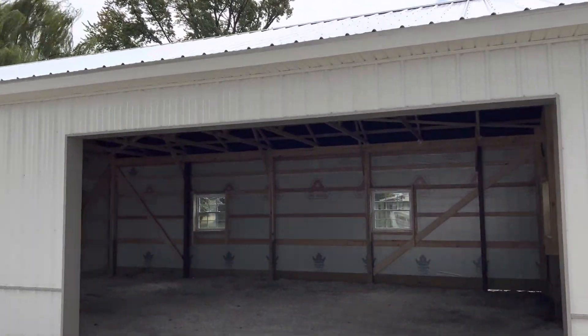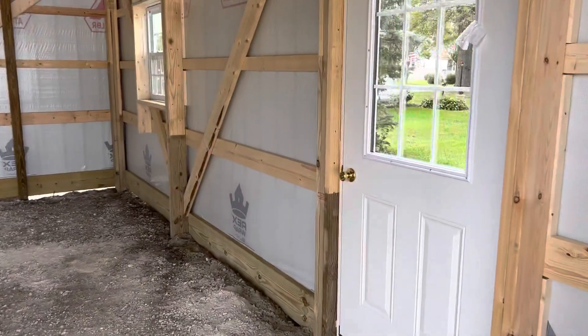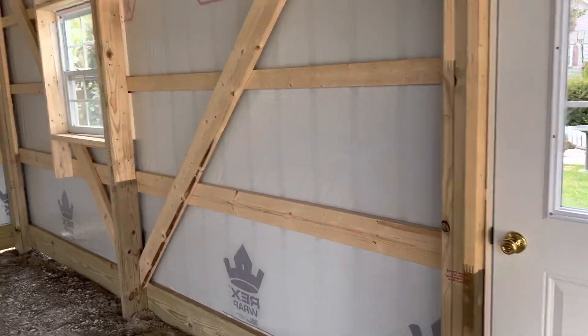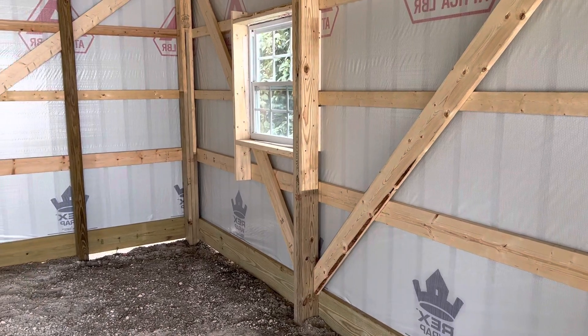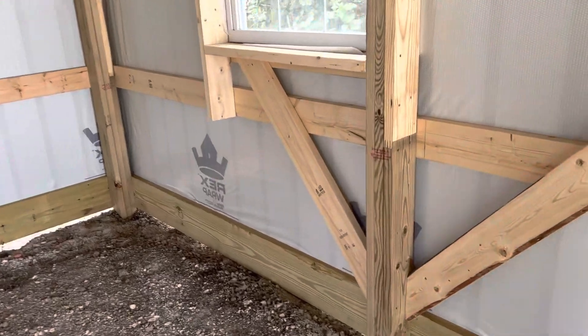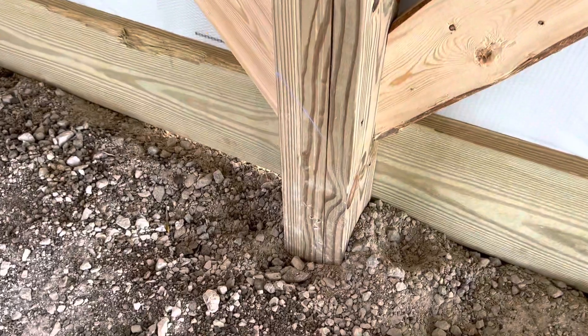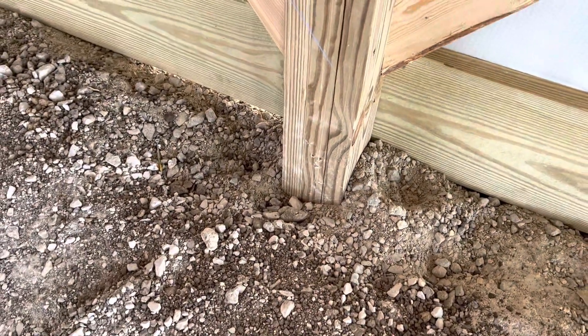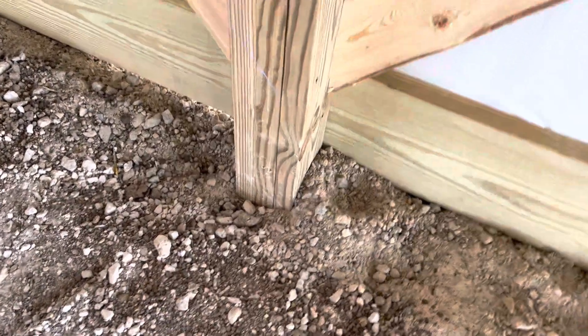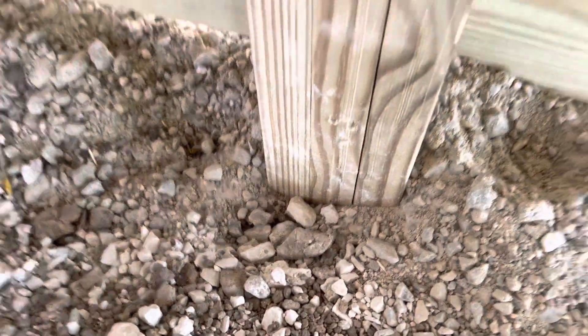Let's go inside and take a look. You can see the owners chose actually three-ply laminated columns — again, southern yellow pine, glued, finger-jointed, and laminated together, treated at the bottom. You can see that nice 2 by 10 rim board. We drill down actually 54 inches — this is again in Sandusky County, Ohio. We go down 54 inches, put that right on a concrete cookie, put uplift protection with treated boards at the bottom, and backfill it with 411 stone. You can see that stone mix right there, tamped down.